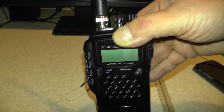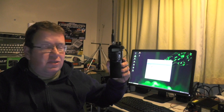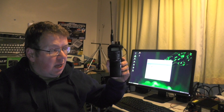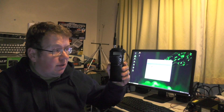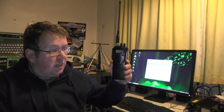Now the reason I've done the mod is I want to use it for 10 metres. That was nice and simple, that mod. So there we go, YouTube - we modified the Albrecht 2990 ASF handheld. We went from 25.110 right the way up to 29.650. The reason I've modified it is because I want to do 10 metres on this, which is the main reason I bought the handheld. Thank you for watching this video. If you find this video useful, give it a thumbs up. If you don't like it, the other button seems to work too. And I'll see you in the next one.